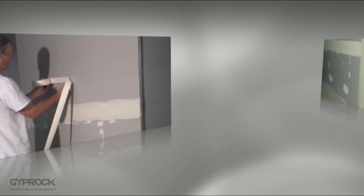For more information on critical lighting conditions, check out the glancing light brochure in the Gyprock residential installation guide, both available from gyprock.com.au. The Gyprock jointing system is made up of the first coat, which includes jointing compound and reinforcing tape, followed by two further coats of compound.